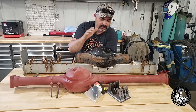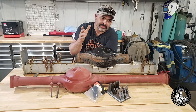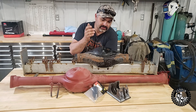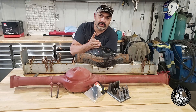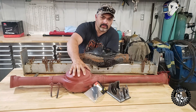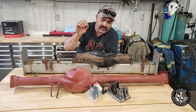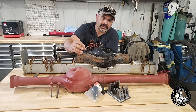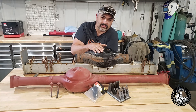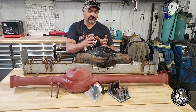The advantage with the bigger gears is they're just plain tougher. They're easier to get — pretty much a dime a dozen — and there are quite a few different offerings: 4.30s, 4.62 I believe, and 5.29s. You can get those gears with the Samurai diff, but the Samurai ring gear is smaller and less beefy. As soon as you start going up to 5.29s you get less pinion contact with the ring gear. Whereas with the Tracker or Suzuki Sidekick diff, you have way better contact, and it's just a beefier gear set.